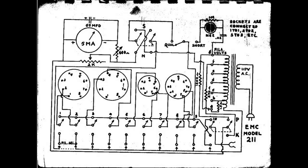Now, whoever manufactured the tube tester, they would have gotten a tube that they tested on a much better tube tester than these, or got 5 or 6, say, of any number tube and tested them to come up with what a good tube is, and they'd probably say that, okay, a good tube would test 100. That's why most of the testers go over 100, because you allow for leeway.